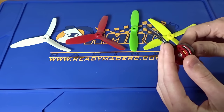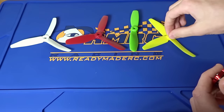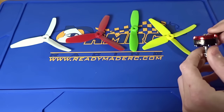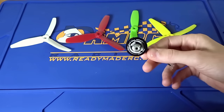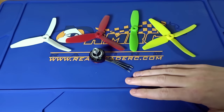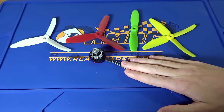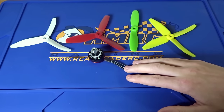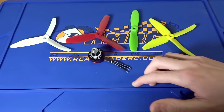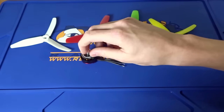Overall, I'm really excited about this motor. It's got tons of torque to drive all these propellers — up to this heavier quad-blade and heavier tri, as well as down to some lighter tri-blades. The 2300 kV is very versatile and pretty much will take any prop you can slap on it. I'm really happy with the results from the bench test. I can't wait to get this on the build — this is provided from FPV Model, part of the ZMR210R kit. I'll leave a link down below and will be doing some builds on this, so hopefully I'll have this flying on a copter within the week.